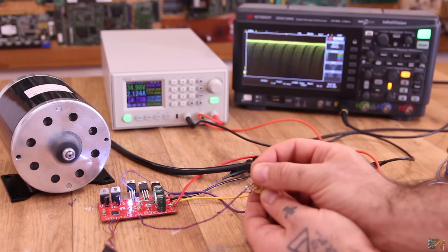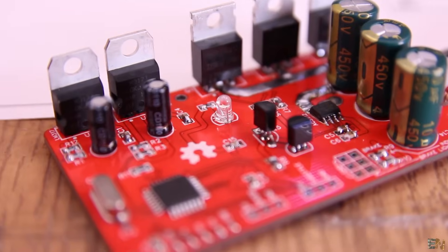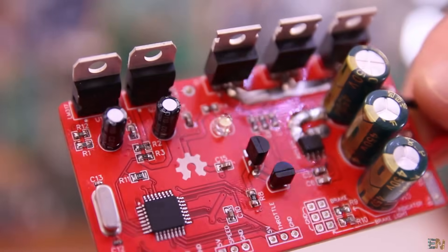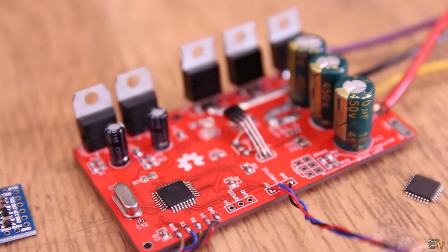Let me talk a little bit about the fail. To control a MOSFET and this kind of motor you use a PWM signal through some MOSFETs. To control MOSFETs you need to apply a higher voltage than the 5V you use with the Arduino, so for that you usually use a driver. In my case I was trying a driver made with BJT transistors — I found one on the internet using an NPN and a PNP. So you have a sort of inverter: when the input is high the output is low, and vice versa. That inverter wasn't working well — the maximum voltage I was reaching at the output was only 6V. So I had to change the driver and add a pull-up. I have a small transistor soldered in the air with a pull-up, because the PCB was made for two BJT transistors.